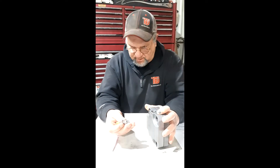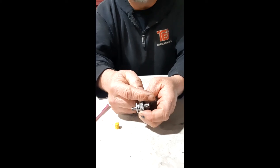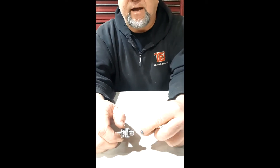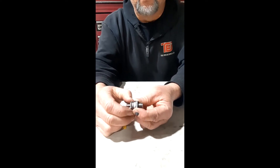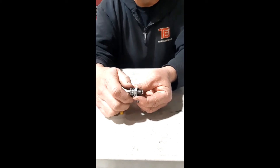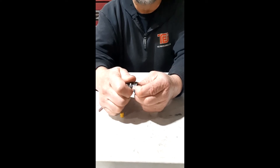This charge port has a cap on it, which is extremely important — if you get debris down in there, the nitrogen won't go through into the accumulator and do what it's supposed to do. In the closed position, this part down in here is like a seat that seals the nitrogen inside the chamber. When you unscrew this nut, it opens this seat.